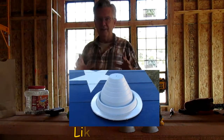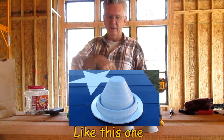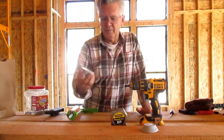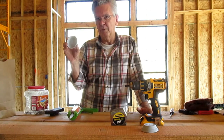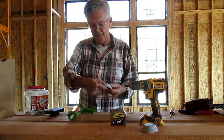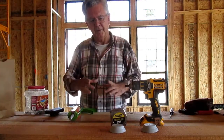It's just a rubber boot, kind of cone-shaped, with a metal flange around the bottom of it. The first thing you do is cut the boot to fit the size of the pipe. It has markings for different sized pipes and you cut it at the size that you need and just slip it over the top.